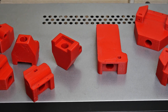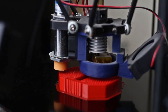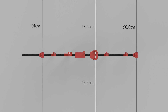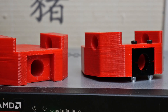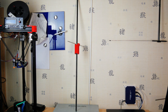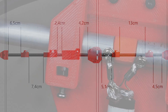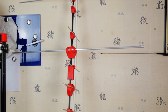Before we start, we can first prepare the plastic parts. Once we have all the parts, we can begin building the antenna. The element dimensions can be found on my website. We are going to mount the 3D-printed holders together with the elements onto the carbon boom. You will find the two feed points, one for each band, in the middle of the antenna.